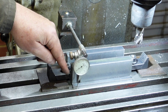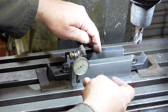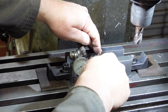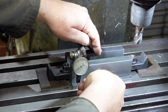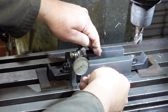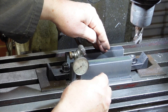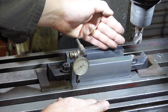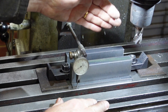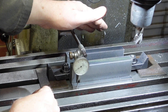I've got my vise base here — I've milled off the ends and I'm now going to take that material off the top and then put a couple of rebates in here. I've got that trammed in so that my cutter, when I'm feeding and cutting the rebate, will be parallel with the side. That's not horribly important but it means if I'm putting this on the table I can put a square on there and know that the vise jaws will be parallel with that edge of the mill. It's not highly important but you do want it so that if you have something in the vise and you're taking a cut, that cut is relatively parallel.